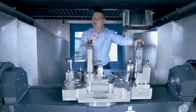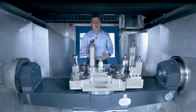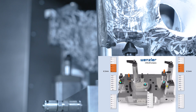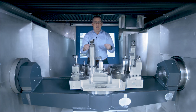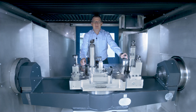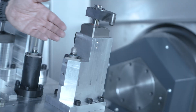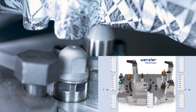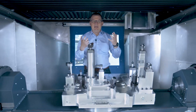There will be no false position anymore. And there's more to come. I've already talked about this rocker — it is equipped with a measurement path control. Just imagine, even warped parts can be measured and you can make sure that they are within the tolerance to be machined. What's more, we have this supporting point with a classic back pressure control. And look at this: thanks to clamping force measurement, you can decide exactly whether the clamping is correct or not.